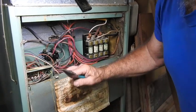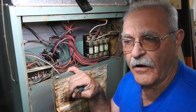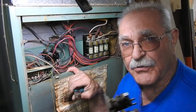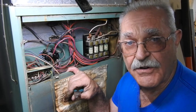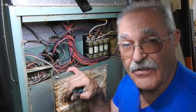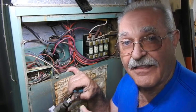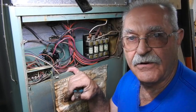In conjunction with that, if you have a furnace that's a little bit too big for your structure — say you have five or six elements — you can take that fifth and sixth element and wire that last stage through an outdoor thermostat. Set that outdoor thermostat below the extreme temperature you normally average. When it does drop below that, then and only then, whenever the furnace no longer maintains the heat, the outdoor temperature will close that thermostat and those elements will come into play, boosting your house back up to comfortable temperatures.